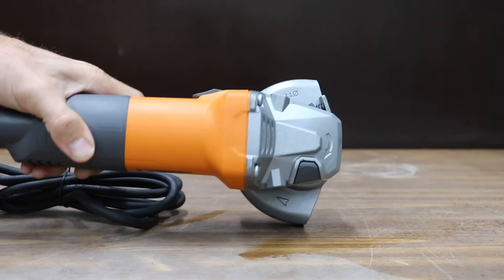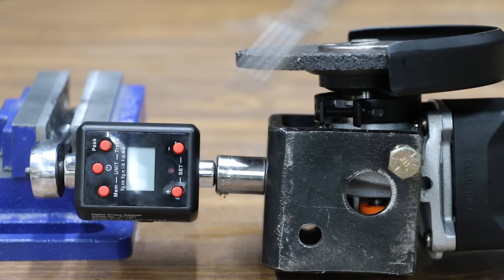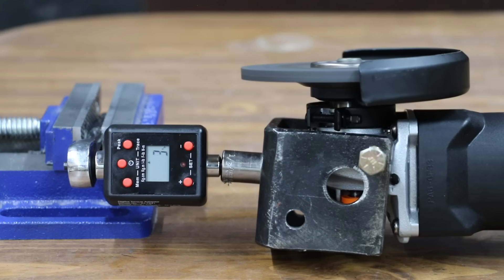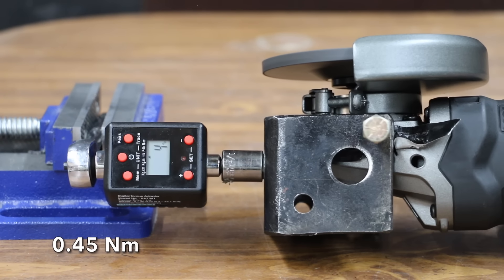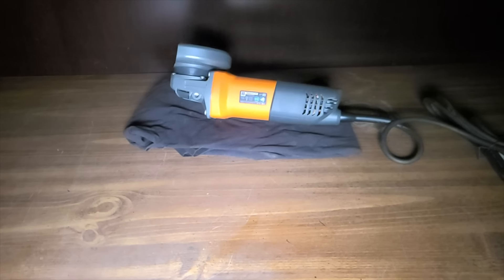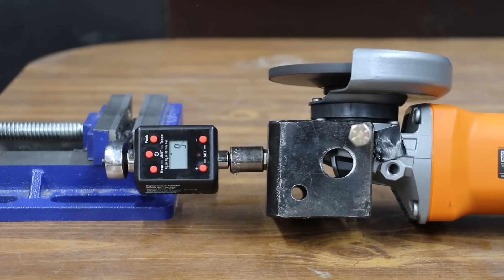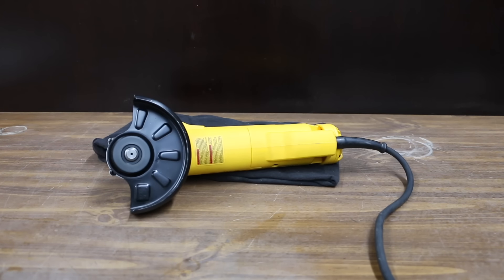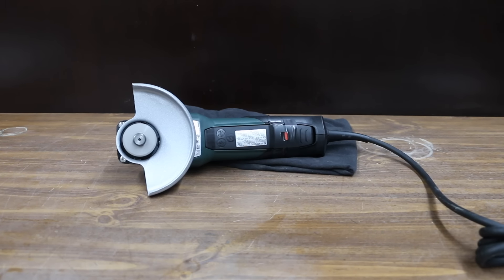Most grinders have a barrel grip which can be hard to grip with one hand, so let's compare startup torque. Using a torque adapter, the 4.3-amp Warrior produced only 3 inch-pounds of tool reaction torque. The Wind performed the same as the Warrior at 3 inch-pounds. The Black & Decker nearly came off the table at 4 inch-pounds. The Porter Cable matched the Warrior and Wind at 3 inch-pounds. The Ridgid did a flip and nearly threw itself off the table — definitely recommend a secure two-handed grip — at more than twice the tool reaction torque of the other brands at 9 inch-pounds. The Ryobi rolled over but didn't get too excited, and the startup torque was too low for the torque adapter to measure. The DeWalt registered 5 inch-pounds, and the Metabo 6 inch-pounds.